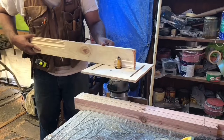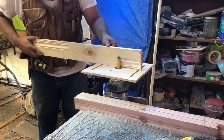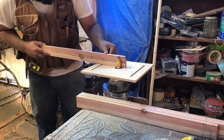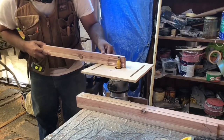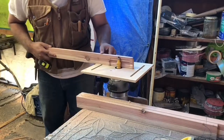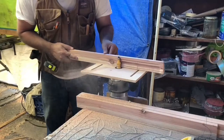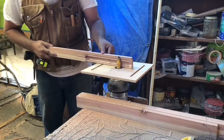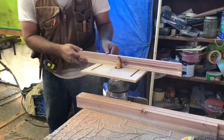And things like here, I'm cutting a few inches of practice board on this new router bit, and I'm like, okay, I'll do it on the real thing now, even though I spent all this time milling it out to be perfect. I'll risk my good stuff just thinking, oh, I have the bearing, and I'll just hold it straight. So at first, I'm worried about this knot, and it handled it rather well, but the problem is that it's rocking on its edge, so it's not coming out even.